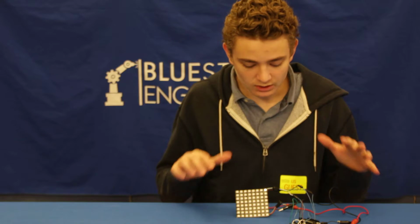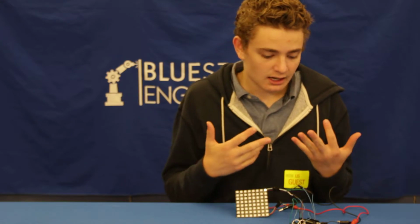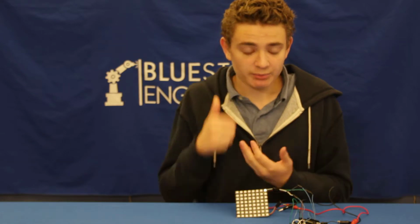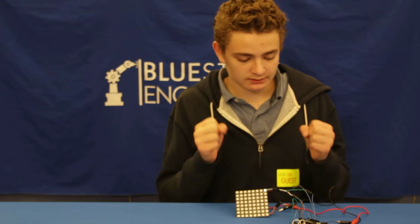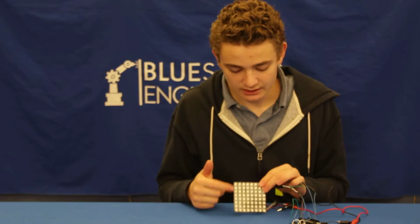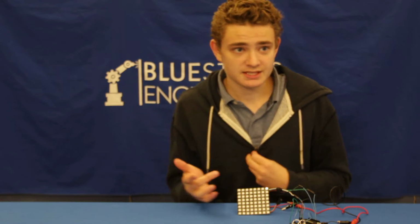My first milestone was to basically set up the game, download the code to my Arduino, and make sure that it gets up and running. What I learned, a bunch. I learned about breadboards, I learned about tact switch circuits, learned to never plug in two power sources to your Arduino because it will fry and you have to get a new one. I learned that there are different models of NeoPixel boards, and that is also relevant to how people code their games. And I'll get into that a bit more in the problems section.